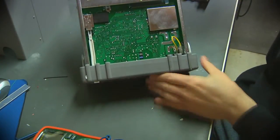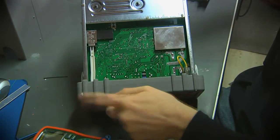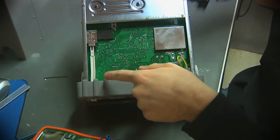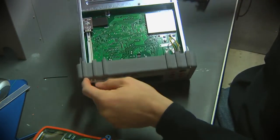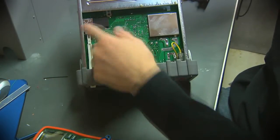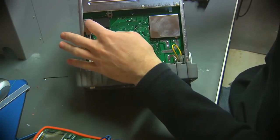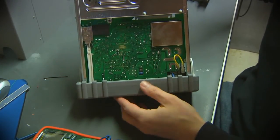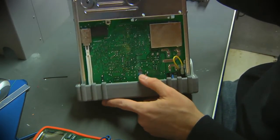So here's another look. This is the underside of the main board. Now I start to understand why those lines from the transformer go onto the main board. The front panel switch, sort of in the classic style, is a really long actuator that goes to the back corner of this main board, and that's actually where the power switch is. It's interesting they would take it that far back and put it there and not have it be part of the power supply board, but the power supply board wouldn't necessarily need to have any AC on it normally either, so I guess this is as good a choice as any.